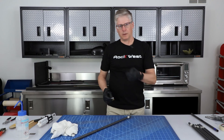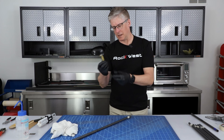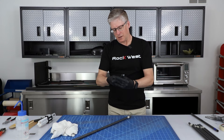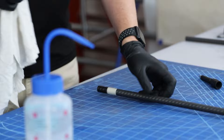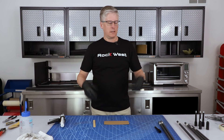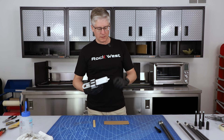It's perfect. We need to scuff up this little piece a little bit just to make sure we have enough, and I'll use the same technique as last time — wrap a piece of sandpaper around a dowel or in this case a sharpie and just scuff up the inside. That's nice and clean. Got them all cleaned. We cleaned off the inside, we cleaned off the ends. Now we're going to mix some adhesive, glue them together, and let them sit overnight.